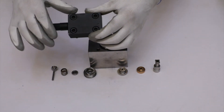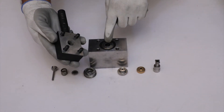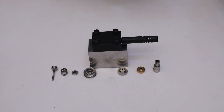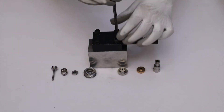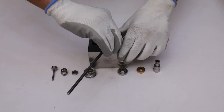After that, place the O-ring on its groove of the main body. Then put the distance piece on its position on the main body. Screw all four M8 by 30 HT cap screws with the help of an Allen key and tighten them properly.